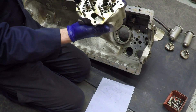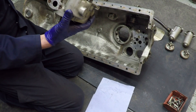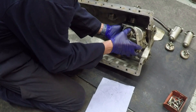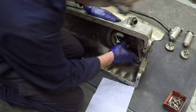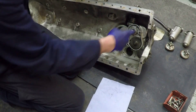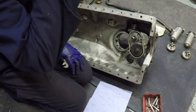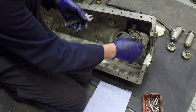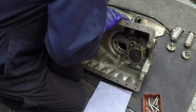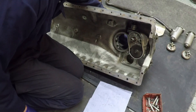I've got this tilted over on its side because these gears will fall out if I try to put it in vertically. There we go, it's in. So now I'm just going to fit the bolts. The three bolts are passed through this casing through the bottom and have to have soft aluminium washers on the outside to stop oil leaks, holding this casing on. The rest of the studs are going to be used to fit the oil pressure pump on the outside.